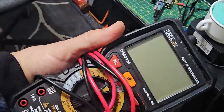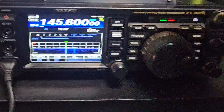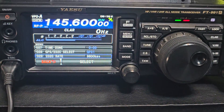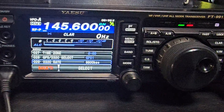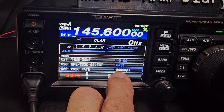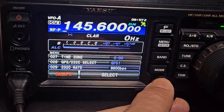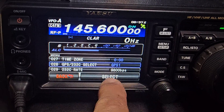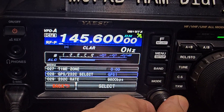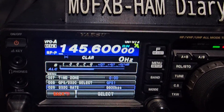You can test it with a voltmeter, which is what I did. Regarding the settings, just press the menu button like so and go down to menu 28. At the moment I've selected GPS — I thought I should select RS-232, but I found that GPS 1 worked. Then go down one more. So menu 28 is where you select GPS, and the next one down, just turn the multi knob; I've selected 9600 baud because that's what's advertised with the module I purchased.